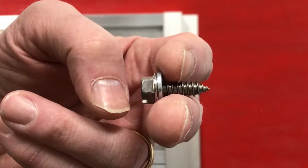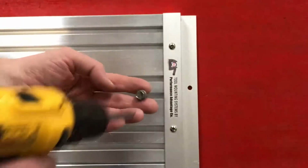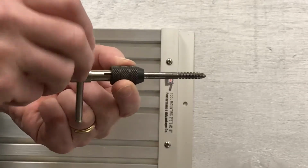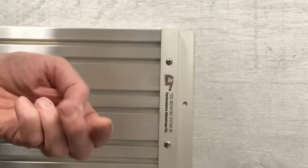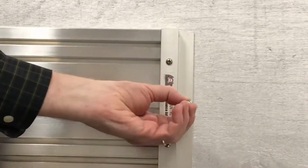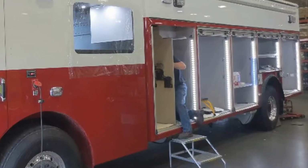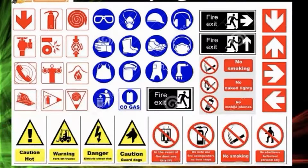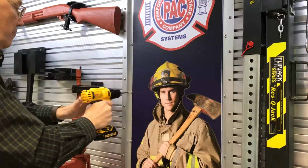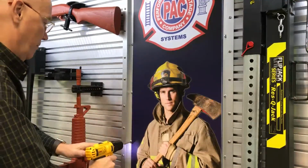For compartments made of steel or aluminum, most end users will mount using self-tapping fasteners. For stainless steel compartments, where galling may occur, users may decide to drill and tap using machine screws and lock washers, for example. While each installation can be different, the important things to consider are standard industry practices for safety, corrosion protection, as well as a schedule of periodic checks to ensure that the fasteners remain snug year after year.